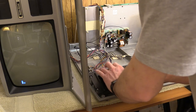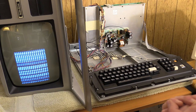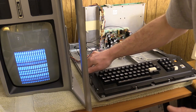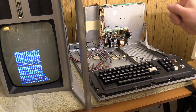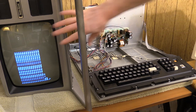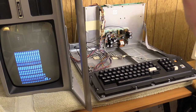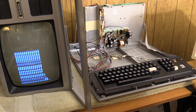Look at this! Oh my goodness. We've got some adjustment to do, but look at this — it works! I'm very happy about this. There is a horizontal and vertical adjustment on this. It's a little bright, but look at that! We did it! So the original video driver board that came with this had an issue. The irony is we actually had two issues. The original board had a little bit of a pop, but at the same time there was a break in the coil. I wonder if that explains some of the weirdness I was seeing when shutting it off and everything was kind of down the middle. That is just friggin' awesome. Cheers to the Model 3 being back — we've got some adjustments to do, but that's awesome.